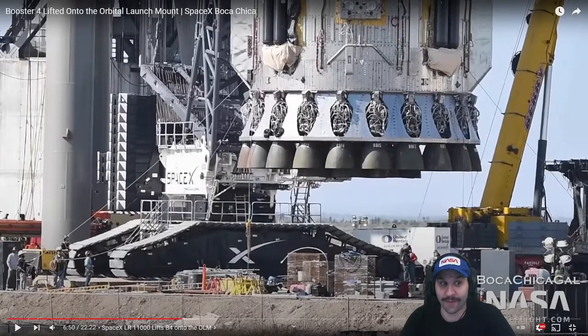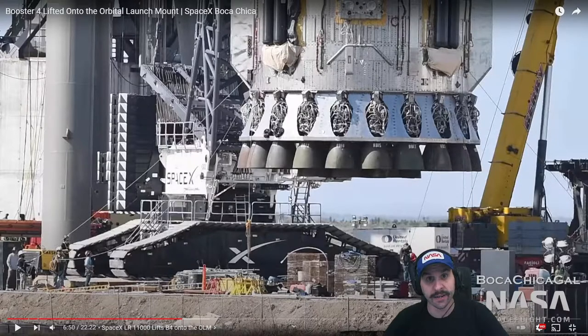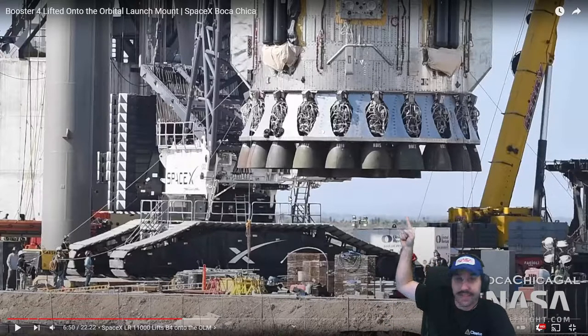Look at how much counterweight this guy has in the saddles, man. Each one of these triangular things is 10,000 kilos. So 1, 2, 3, up to 15. That guy has 30 counterweights, 15 on each saddle. So 30 times 10,000. That guy has 300,000 kilograms of counterweight in this configuration. If you don't understand kilograms, that's 660,000 pounds. Crazy, right? He's running 300 tons of counterweight. That's insane, man. And that should give you a good idea how heavy that thing is.